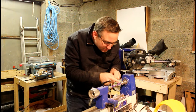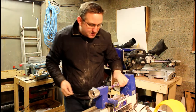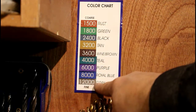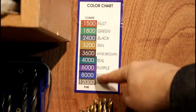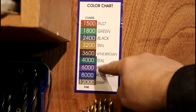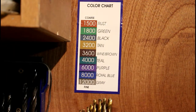There's a little line on there so I'm just going to go back over that, and then I'll start the micro mesh sanding. When you get your micro mesh kit you get a color chart — it starts at 1500 and goes all the way down to 12000. I've got mine already stacked up in order ready to go, so I can just wet sand all the way through and that's going to really bring up the polish on the surface of the acrylic pen.